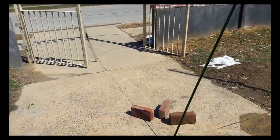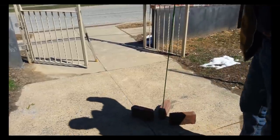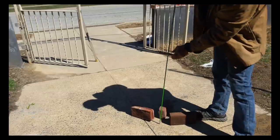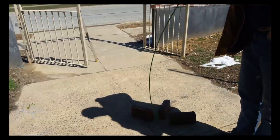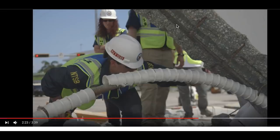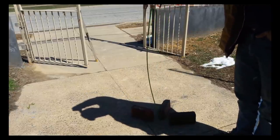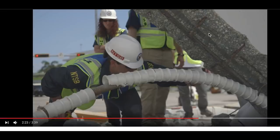And what I'm going to show you guys is, if this is the rebar, the reinforcement inside that column, if it's not straight, even under compression, if it's leaning this way and you put it in compression, look what it'll do. It's going to buckle. When it buckles, it's going to create a force, a moment that lines up, it appears, with the entire failure of this concrete. Any leaning of it, any offset of it, will create the pressure to go towards that direction. There's the other version of the 1-inch on this side. This cable being so close to this 1-inch reinforcing rebar under compression, once you tension this cable, I think created the buckling effect.